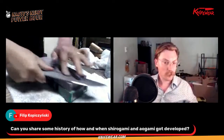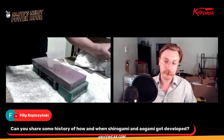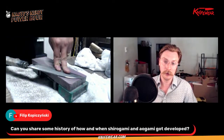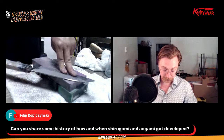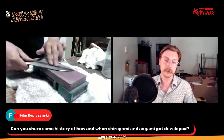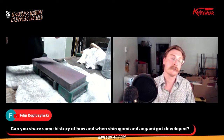Yes, by adding other elements to it, a tiny bit of chromium and stuff, for quenchability or hardenability. The white carbon steel, because it's so pure, is very finicky. In order for blacksmiths to get the best results out of the steel, the temperature window was really narrow, or it had to be quenched at a certain speed and everything. It was hard for some blacksmiths. So they add, say, chromium to the steel so that it can be quenched in oil, yet still gets about the same hardness.